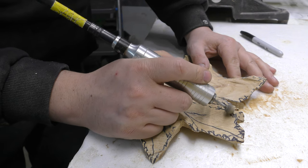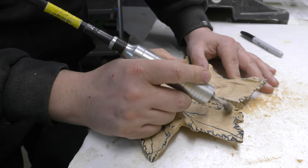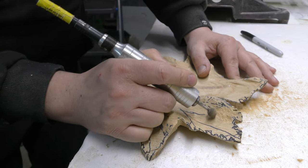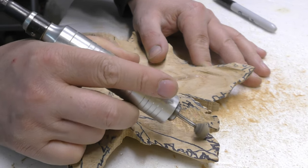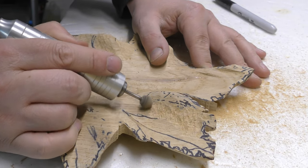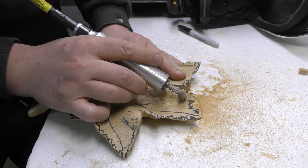I meant to tell you — don't start carving with a piece of oak because you are not going to enjoy that. Oak is hardwood, really hard to carve, and that's probably going to ruin the whole experience for you. Just grab something else — a piece of ash. Ash is easy to carve, or walnut is easy to carve. Anything that is soft. I'm not sure about lime wood — I think that might be way too soft for power carving, but I've never even seen lime wood before so I can't tell you.